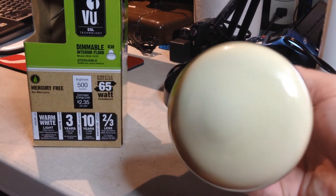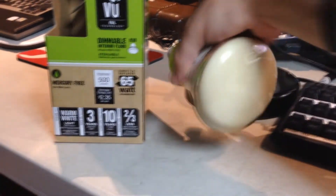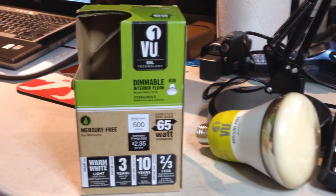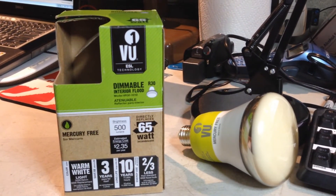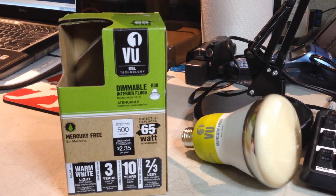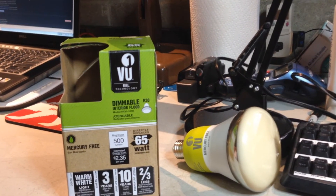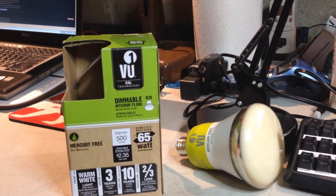So yeah, you can't see a picture on this, but it's pretty much a picture tube. Here's the box. The phosphors on it pretty much resemble that of a black and white set, or just like that monochrome IBM monitor — it's the same thing, just a different color temperature. Where the IBM monochrome is more like 6500 Kelvin, this is 3200 Kelvin, hence why it's yellowish looking.